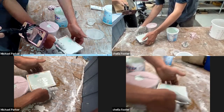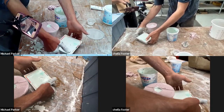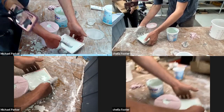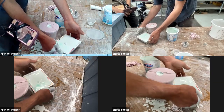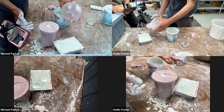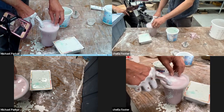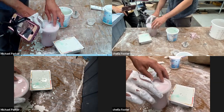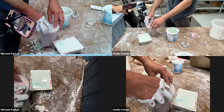We're going to be leaving this set with plaster inside it. Alginate molds, since they're made of organic materials, aren't usable forever — they dry out and you can only use them for a short amount of time. Is there anything we can do to extend that lifetime? Yes — you can take a lid and cover it, or wrap it in plastic or put it in a plastic bag to save the alginate so it doesn't evaporate and dehydrate. You can also put it in a refrigerator — if it stays cold and closed up tight, it'll last a lot longer.